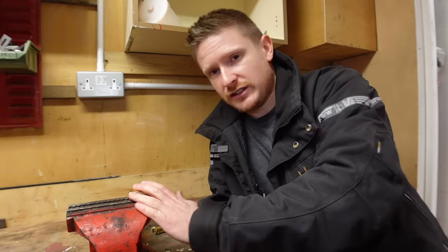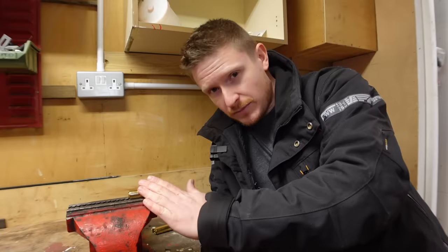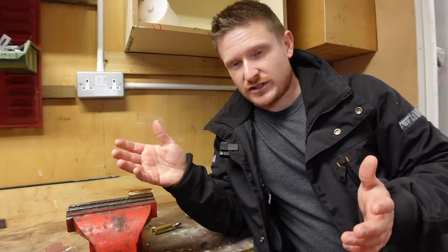It's important to select a high quality lock when purchasing a euro cylinder — don't just go for the cheapest thing from your high street retailer. Personally I'd always go with Yale three-star or Ultion locks. A thumb turn can be worth having if you're concerned about fire risk and getting out quickly without a key, but if you've got a glass panel next to the cylinder, avoid a thumb turn — someone can smash the glass, reach around, and turn it. So you have options, but definitely stay away from cheap locks.